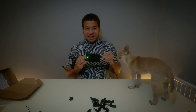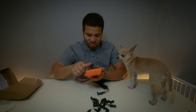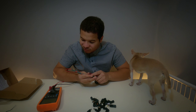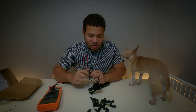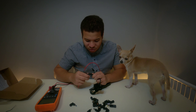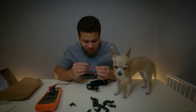As you can see, there's that one little LED like I was telling you about. I want to go ahead and put a connector on it and use the trusty multimeter to see what voltage it's outputting. Right now it seems to be outputting 20 volts with this connector. So if this is a 20-volt connector, let's try one of the others. I recognize this one — it looks a lot like the Dell connector, so this should be 19 or 19.5 volts. Let's see what this one outputs.